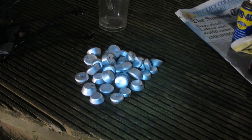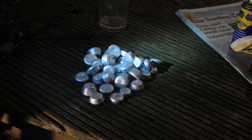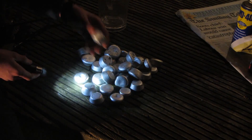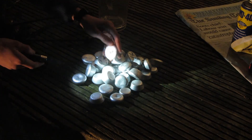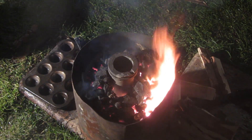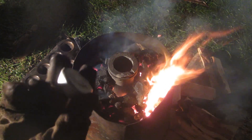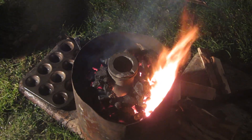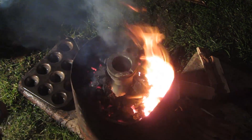After the end of this process I've got a massive amount of solid cast aluminium ingots that weigh quite a lot, and all of these will be enough for tons of different projects. Whenever I want to cast something out of aluminium I can take some of these pure aluminium ingots and melt them down inside the crucible, then before casting the part I'm going to add a borax flux and cast them into a pure substance.